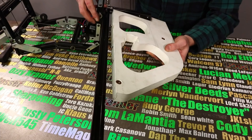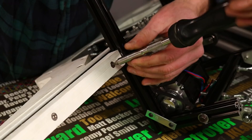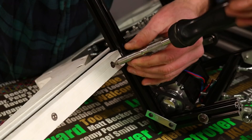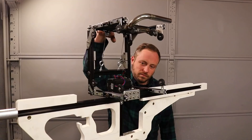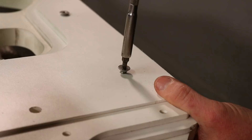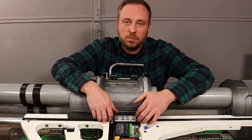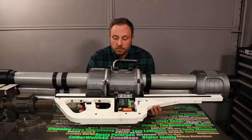Attaching this stock to the frame is a perfect example of one of my favorite parts of builds like this — diving headlong into assembling a unique one-off prototype with a loose plan, knowing there's going to be fun little problems and challenges to overcome. Like the PVC board being far more flexible than I remembered and having to find ways to tie it into the frame to make it more rigid. But also finding lucky little surprises, like aluminum pipe scrap laying around the shop being a beautiful friction fit onto the inner frame, making a perfect front handle extension. Even with the center PVC board tied into the aluminum frame as much as I can, it's still floppier than I want, but I won't know if it's rigid enough until I put the exterior panels on. With all these major pieces starting to come together, this thing is starting to look pretty awesome — so I put the Spanker sticker on.